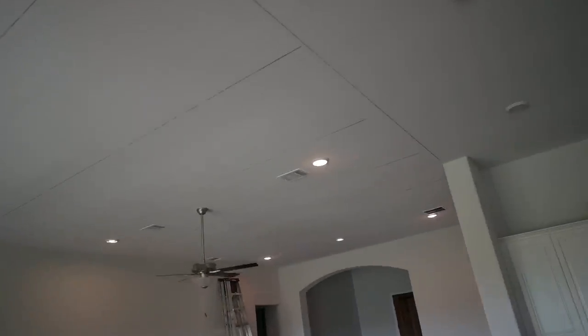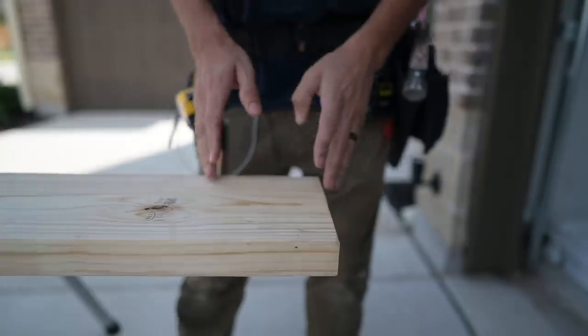Here's a look at the room now. It was pretty intense doing all this alone — I don't recommend it — but thank god for lasers and chalk lines because that's how I got to this point. That big LVL — the laminated veneer lumber beam — is represented by this red line right here. That red line represents where I'm going to put the edge of my framing lumber, and that goes for that big one and all the other eight as well. The blue lines up there represent the furthest extent of the crown molding so I can check I won't hit any lights or vents.